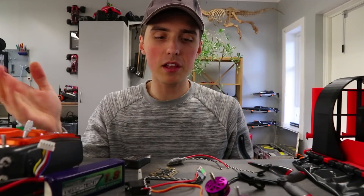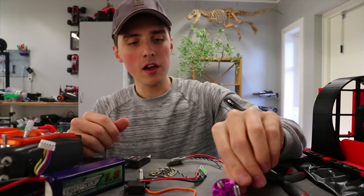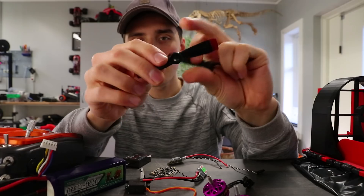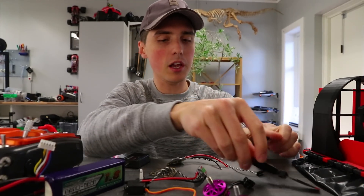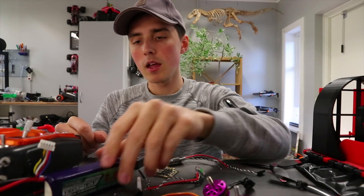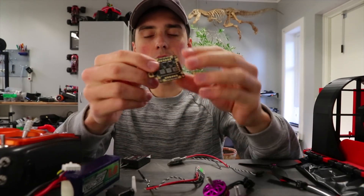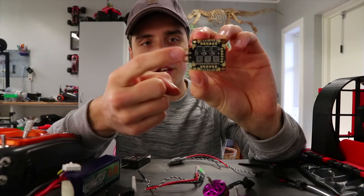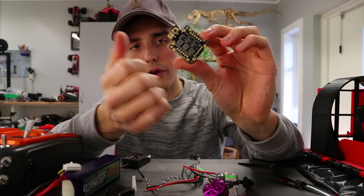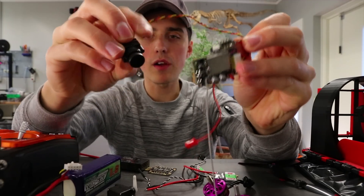The electronics — you could probably get away with less than a hundred dollars. The motors and electric speed controllers are dirt cheap, frequently used in drones. These are some 2300 kV, which means they'll spin real fast. I did a stellar paint job on the propellers; one I had to cut with scissors — just make sure you do it equally on each blade, otherwise they will shake like crazy. The servo I opened up and squeezed some silicone in to protect it from water. The battery is 1800 milliamp-hours, four-cell — that's a lot of power. I'll be using a power distribution board where the battery gets plugged in and you have pads to solder on the ESCs, plus 12V, 9V, and 5V outputs to power the receiver and an FPV camera if you ever wish to spy on your neighbors.